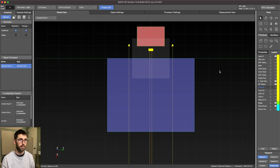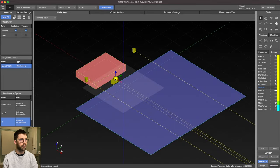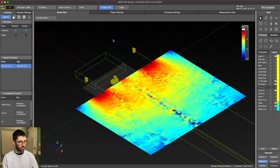If you have VIPs sitting right in the front row and want extra clarity to draw people's attention toward the center, I would add a little front fill. A front fill is a small speaker sitting right on top of the subs. This is another reason I like center sub setups — it makes a nice pedestal for a front fill speaker. You're probably going to want to turn this way down compared to the mains since it's only covering a small region. With all speakers active, you can see that the area in the front is covered nicely — someone dead center gets plenty of high frequencies.